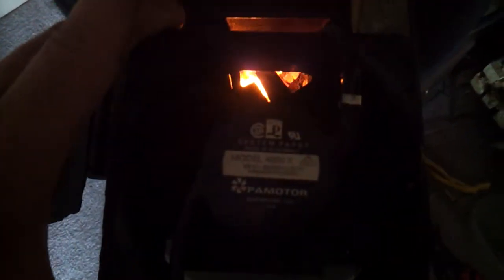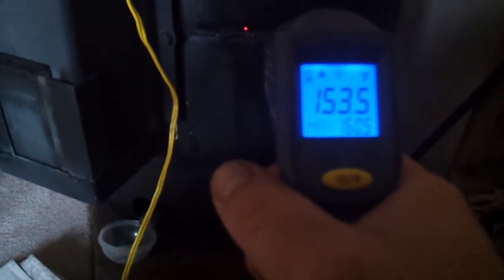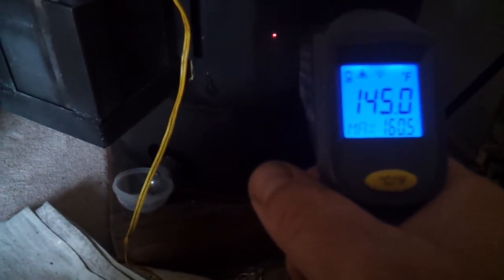The thing's heating great — it's heating the house wonderful. It's like 55 degrees outside and let's see what sort of temperatures we're getting: 246 off the top, 180, 198 there, 158, 156, and we're about 144 right at the bottom. About 98 degrees, 92 degrees on the stove pipe — just depends on where you take the measurement from. Obviously the very top is going to be the hottest.